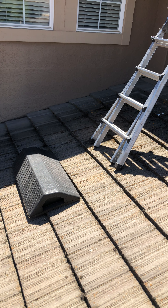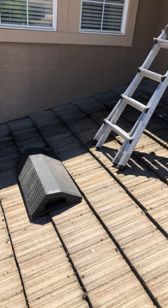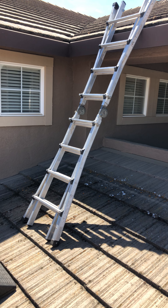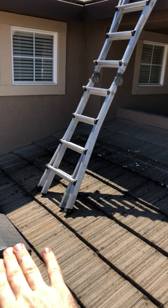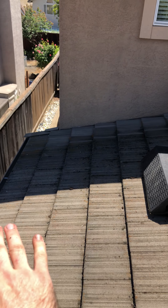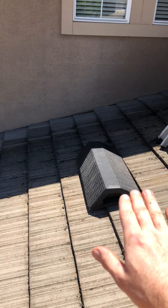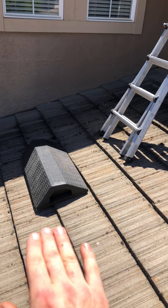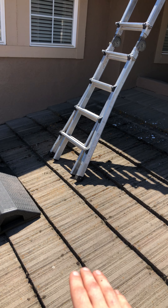In this video we're going to go over how to ascend from the first story to the second story using a pitch hopper and a ladder. You're going to set up the ladder on the flattest area, the flattest slope that you can find, as long as the slope extends for a period where, just in case the ladder slips, the ladder is not going to fall off the edge of the roof. You're going to position the pitch hopper behind the ladder so that if it does slip and the ladder kicks out, it's going to get stopped by the pitch hopper.